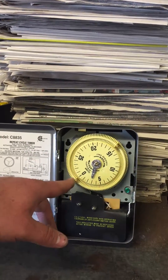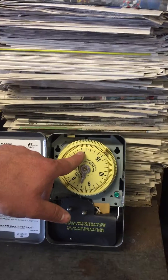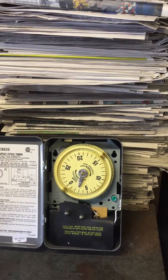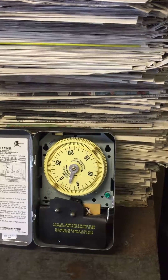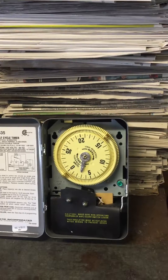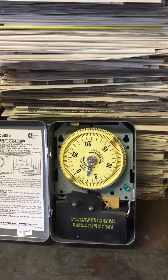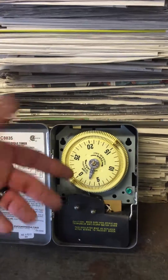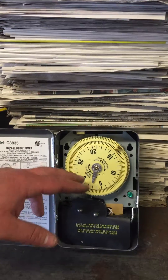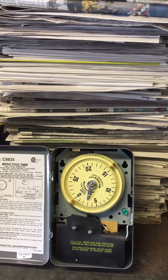As far as the stoves, we have four pins at 0, 10, and 20. And if you really wanted to, you can fine-tune it to get a much smaller burn out of idle fire, which we don't recommend on a stove because that's more meant for a wintertime setup. As far as a boiler, you're always heating and cooling it with your domestic hot water and heat going out to your radiation. So that's why this is typically only meant for the summertime on boilers.